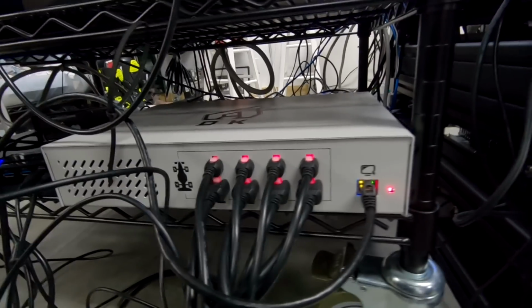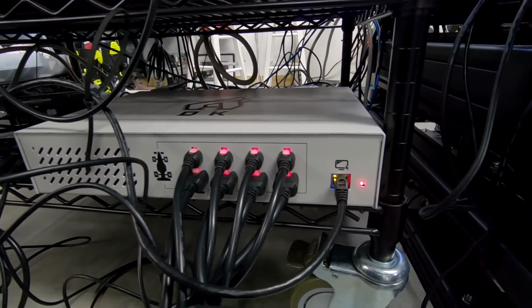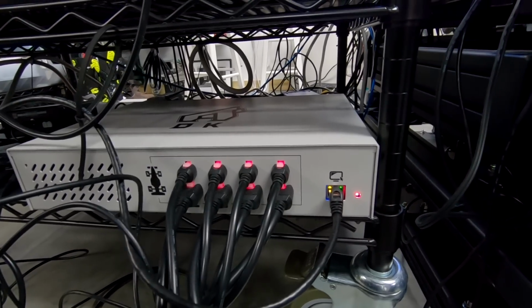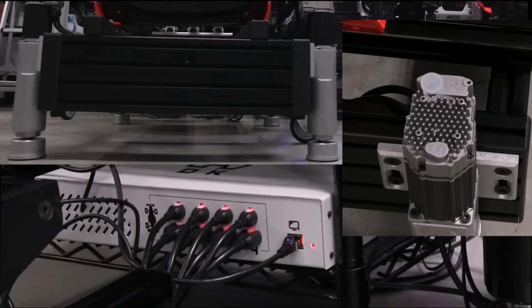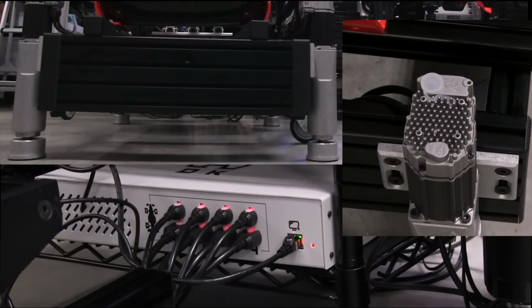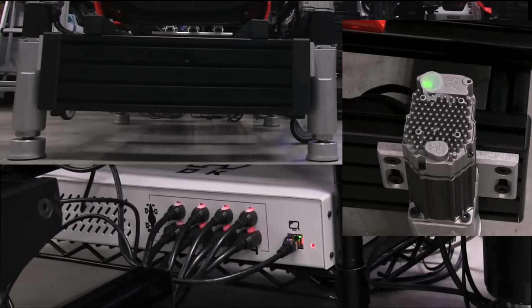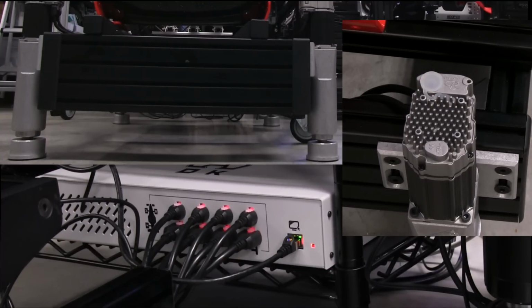Now you can see, obviously, we have the lights on our controller box. And I'm going to show you a little sequence here that goes through a boot up routine, a self-calibration, and I just turn the switch on. You can see the lights come on the controller boards on top of the actuators. The actuators are moving, and it's just going through its sequence there. I think it flashes the yellow light once, but what we really want is that steady green flash, that rapid flash, and that means everything's good to go after it does its self-calibration.